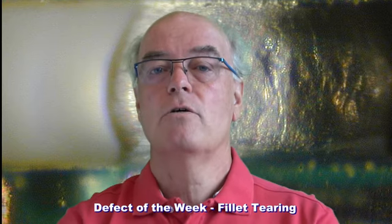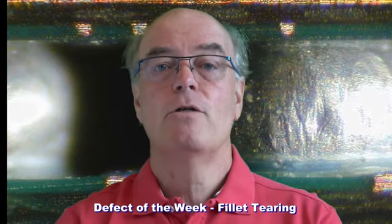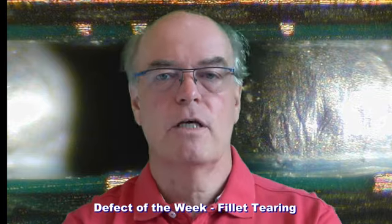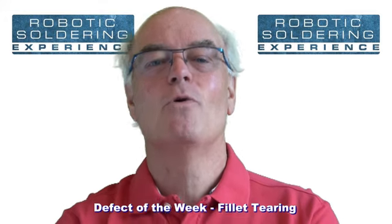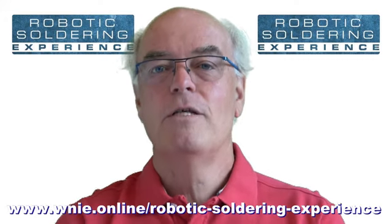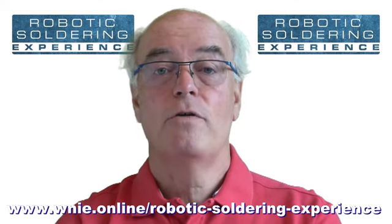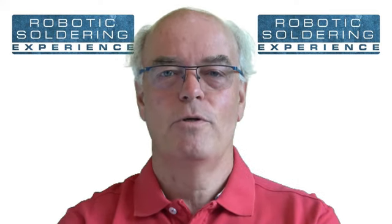You also see it on BGA joints which have been reflow soldered, and this is dependent on the mix of alloys. Now, I tend to have seen this more commonly on higher silver content materials as opposed to the low silver content solders that we use more commonly in lead-free, driven by the cost of the materials. There is guidance and suggestions within international inspection standards to have a look at and reference, but just try taking a look at some joints and see if you see it on any of the joints you're producing.